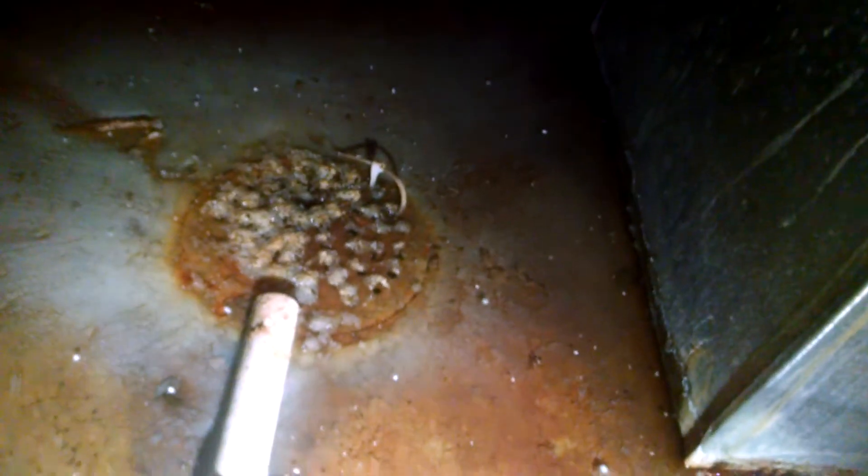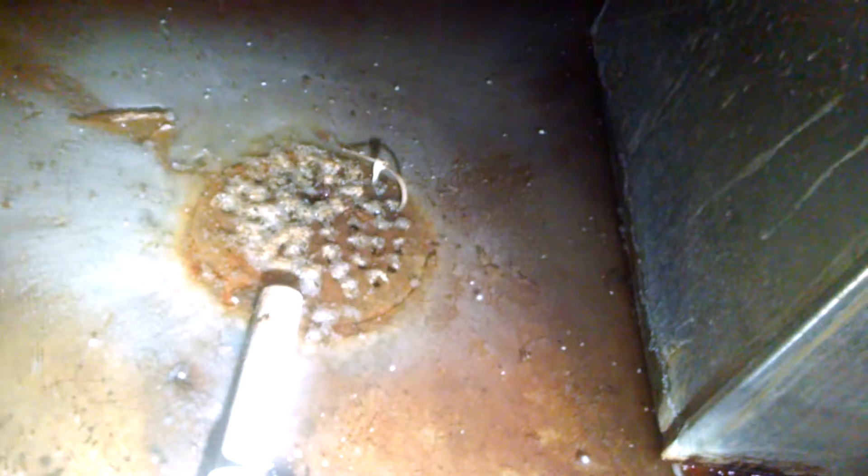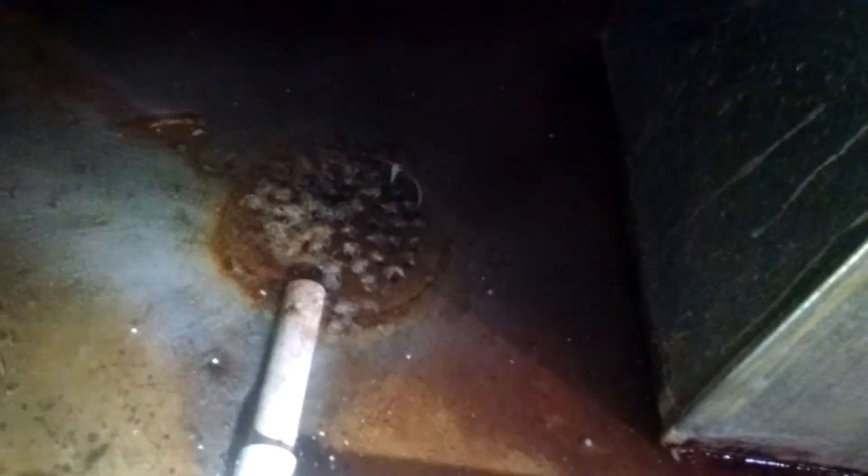The reason we can tell is because I've got the flashlight on — you can see the discoloration going around the grate of our floor drain. And you can also see that it's actually pushing up, so whatever is gross or nasty in there is coming up and not going back down. It's not draining into here — it's actually coming up from it. That confirms it's a sewer backup.